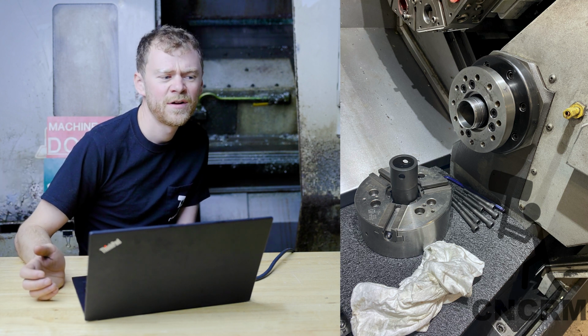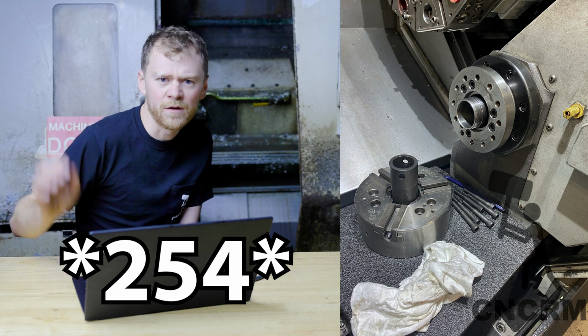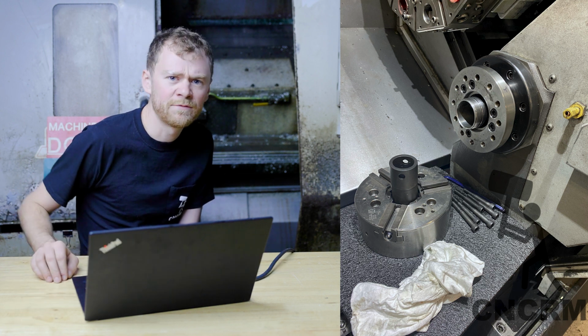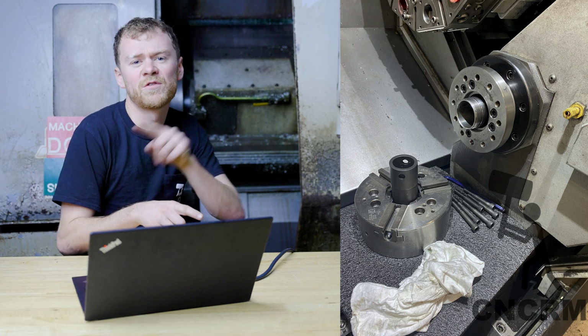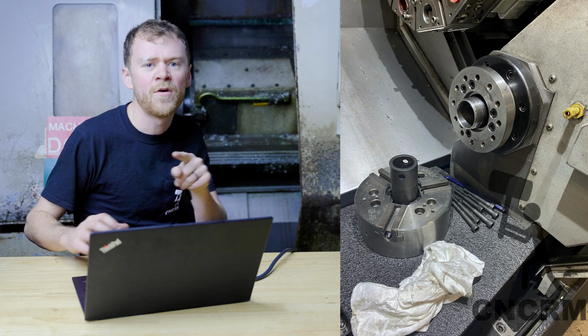You can set the parameter. I think it's 64. It's been a long video. But that's your center line for your spindle. And then what you're gonna do is you're gonna dial it in X and in Y. And if you're a little bit off in X, jog X down a few thou, and then jog Y.